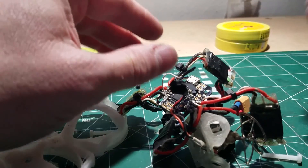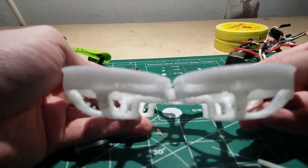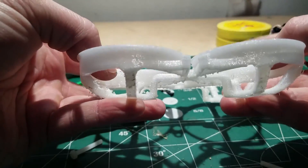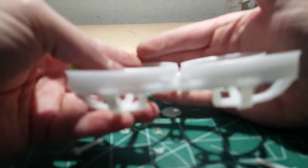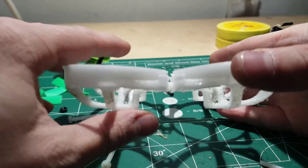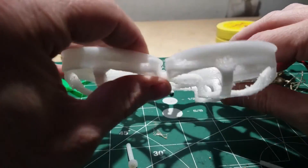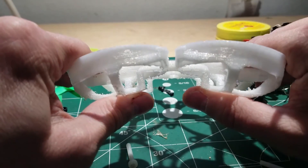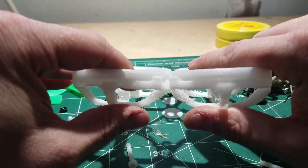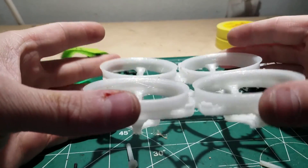It's got hot glue all over it. The other problem I have with this frame is that you can see it's got an angle to it. I'm hoping once everything is in there it'll spread out or stay flat once the ESCs are in it, but both sides are like that. I'm pretty sure that's going to affect the flight characteristics — it may be able to be tuned out. I've never flown a quad this angled. It's almost as if the whole thing is pushing inwards on itself, so it probably gets some crazy oscillations.